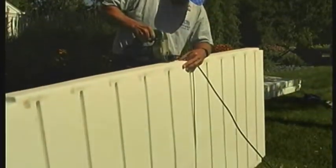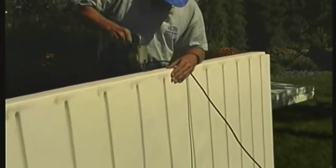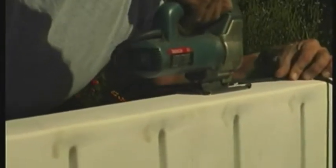Using the saber saw, as shown here, cut a notch about 1.5 inches deep into the deck between those marks. Also, cut a notch 2.25 inches back from the end that will rest on top of the bent arm corner bracket. If the L section is 5, 7, or 10 foot wide, there will be three notches, and you may review the dimensions of the cutouts on this diagram.